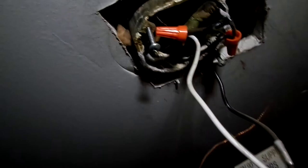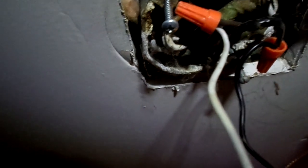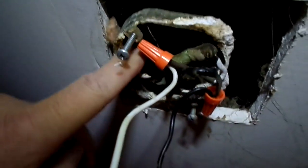What they've done is make this not just a hanger for the light — it's also a junction box for the rest of the circuit. There are actually four different runs of Romex entering this box, joining here, and then joining the lamp. So it's really tight to work in there, and they gave you just enough wire to get into the box with very little you can pull out.